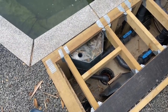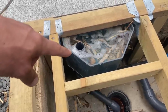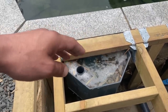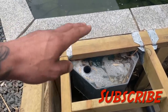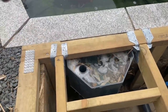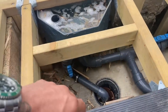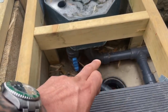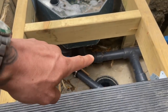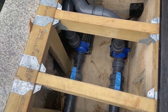This is the skimmer system — this is basically how I've got it running. As you can see there are tons of leaves it's collecting. This is called an Ultra Skim; they're actually designed to go into 200 by 100 blocks. You can literally miss a block out, sit this skimmer where the next block is going, and carry on with your block work. It comes with a one and a half inch waste and a three inch outlet. I've got a two inch pipe coming off the bottom with a three inch to two inch reducer boot.